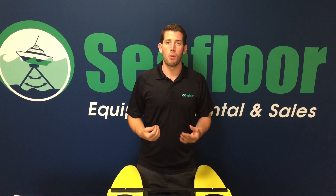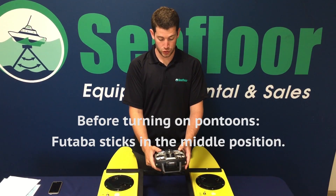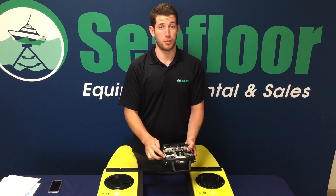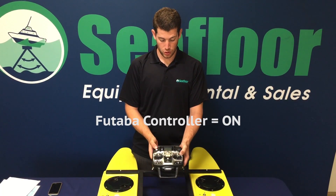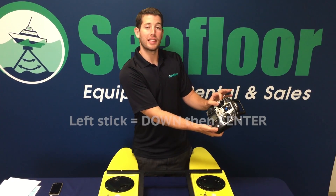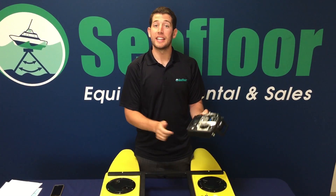Your remote control boat will be on your survey site in the water. Before you turn your vehicle on, please make sure that both Futaba controls are in the middle position. If these controls are not in the middle position, the boat will not start or function properly. You are now good to turn on the Futaba controller. When I turn this on, I get a warning signal — it says WARN-THR. At this point, with the left stick, go all the way down and back to center. This arms the system and gets it ready to operate.